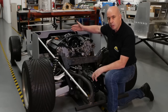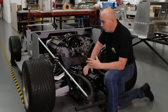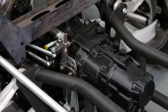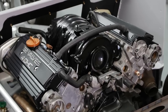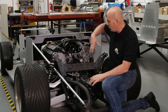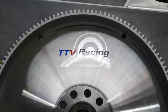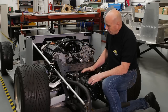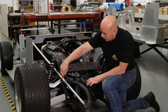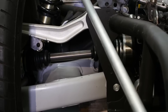We are mid-mounting a V8 engine, but it's got all its own complications and challenges in designing something that's going to go really quick and very well. In the V8 Stealth Beetle we are using a 6-speed manual gearbox which is being driven by an Audi 4.2 litre V8. This engine will be getting two turbochargers as well. Between the engine and gearbox we have a clutch, pressure plate and flywheel which was designed and manufactured in the UK by TTV Racing. Once we've got the engine and gearbox working together, this power needs to be driven to the wheels via drive shafts. The drive shafts have been designed and fitted with special high-performance CV joints which are also in place.